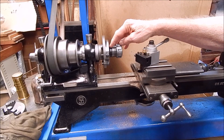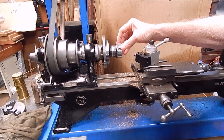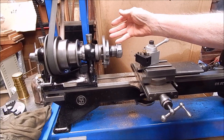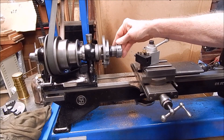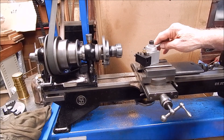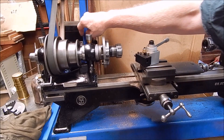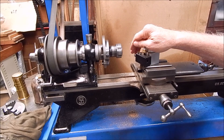This sort of chuck is the way to go because it's got feed-through — you can feed right through the spindle. Whereas the collet chucks that have got a morse taper, you can't feed through because the morse taper's filling up the spindle. There's the old girl, and it shows that it's getting plenty of use — the drive belts are good and dirty. This isn't a decoration model like a lot of them on the internet that never see any sort of work. Squeaky clean.